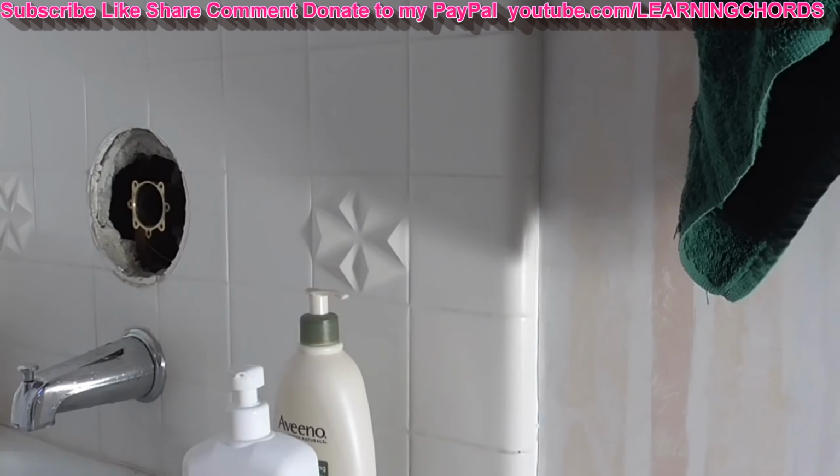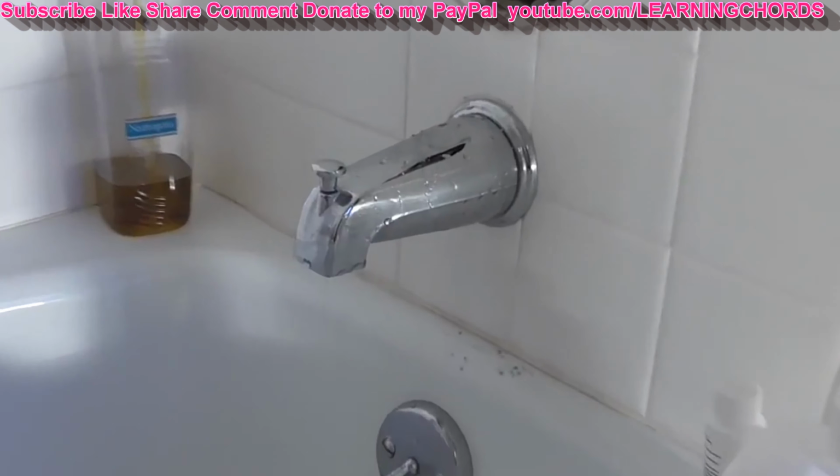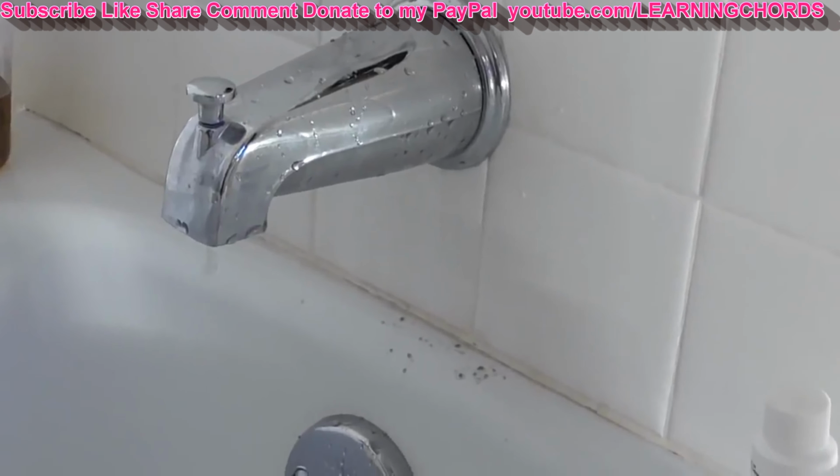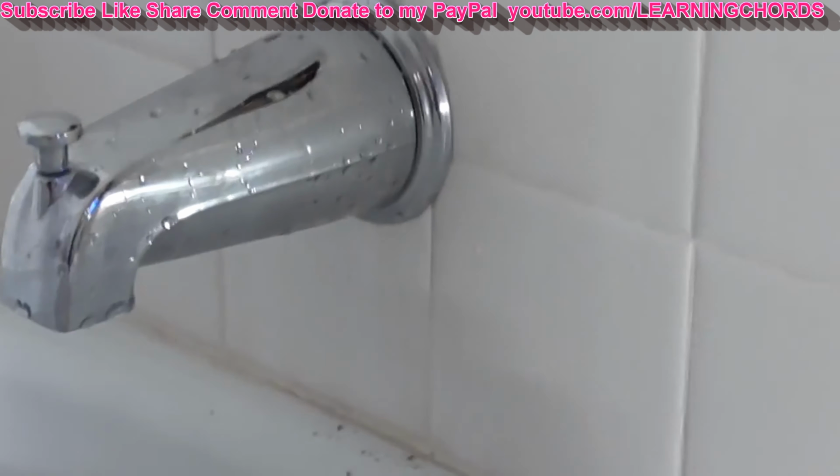A lot of sediment came out of the valve. I cleaned up most of it, but you can see all the junk that came out over there. That all shot out when I pulled it out. And that's probably what's causing this, is sediment.